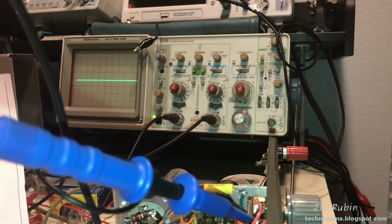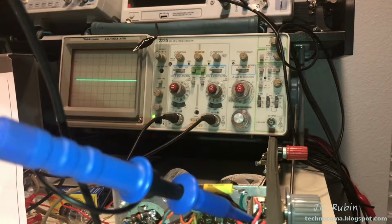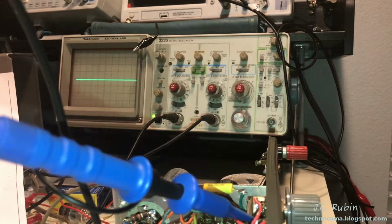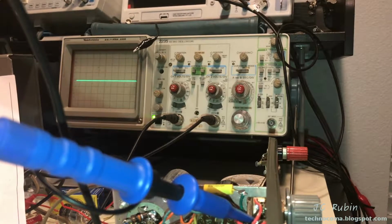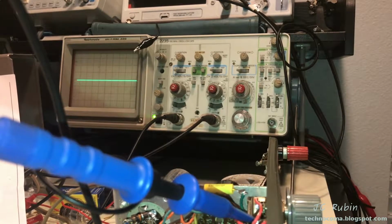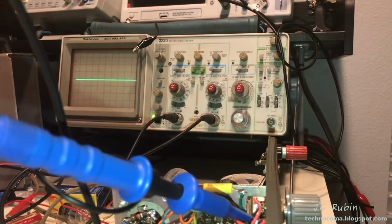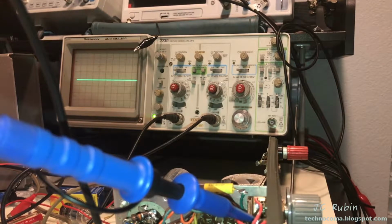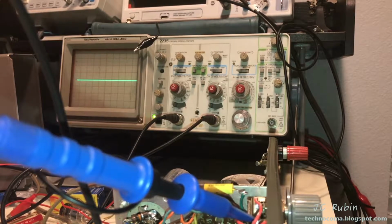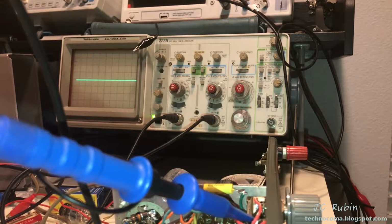Aside from the fact that there are artifacts with the rectifier, which is a separate discussion that's going to come up, the voltages for this 12AX7 are 61 and 77 respectively, with a bias of 0.5 and 0.6. You can't expect any headroom from this preamp at all before it starts breaking up in any sort of fashion, which we want a little bit of distortion here, but it's way too low.